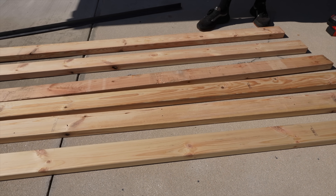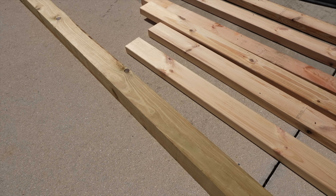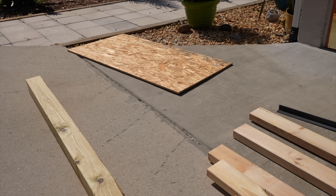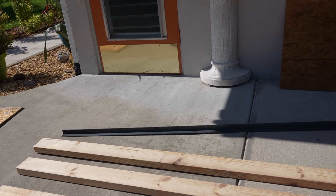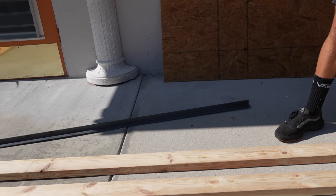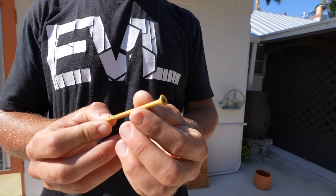So I went to Home Depot and I got six two-by-fours, one four-by-four, and two pieces of fake plywood cut to two foot by four foot — basically just pressed wood, so it's a little cheaper. I got one metal angle iron already cut to six foot, and some special decking screws. All the wood's already pre-measured out, so we're aiming for a six foot long grind box. It's going to be two foot wide, two foot high — pretty much two foot everything, six foot long.